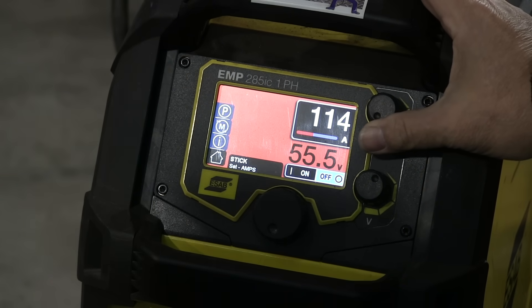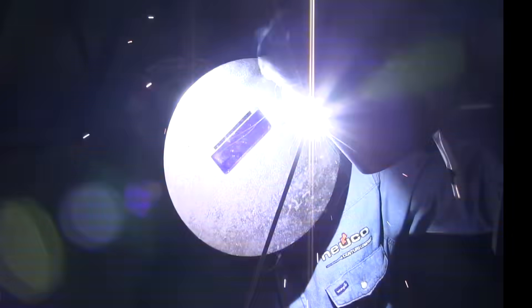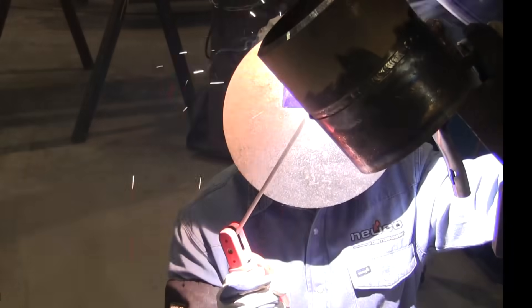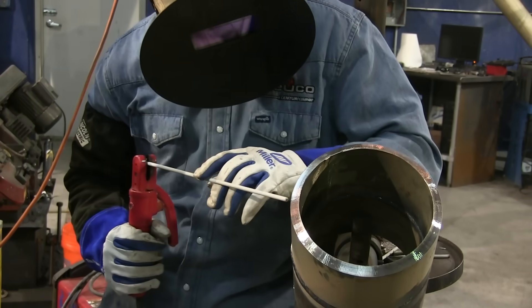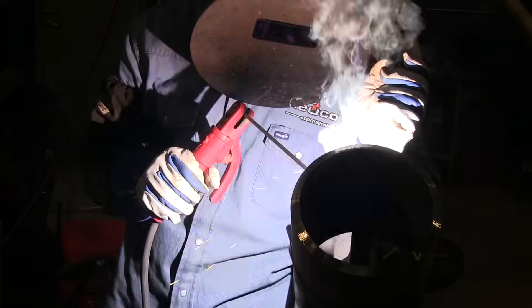We ran the first hot pass at 105. We're going up to 115 for these two stringers, and we let the pipe cool a good bit. Once again, striking up and then coming back and welding over top of the arc strike. Hopefully you can see the rod angle and the way Andrew moves his body and changes the rod angle going up around the bend — the elbow coming up as he turns the corner. On this restart, using the cue stick method again to steady the rod, making sure arc strikes stay where they need to be. He's not doing nearly as much oscillation on this two-bead stringer and moves along a little quicker, gradually turning loose of the rod once things are going well.